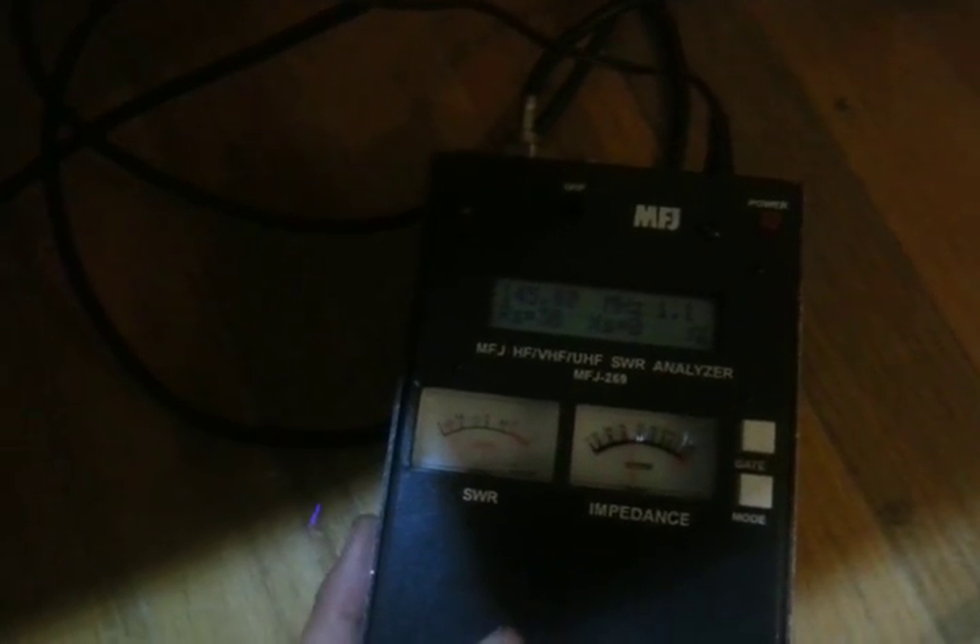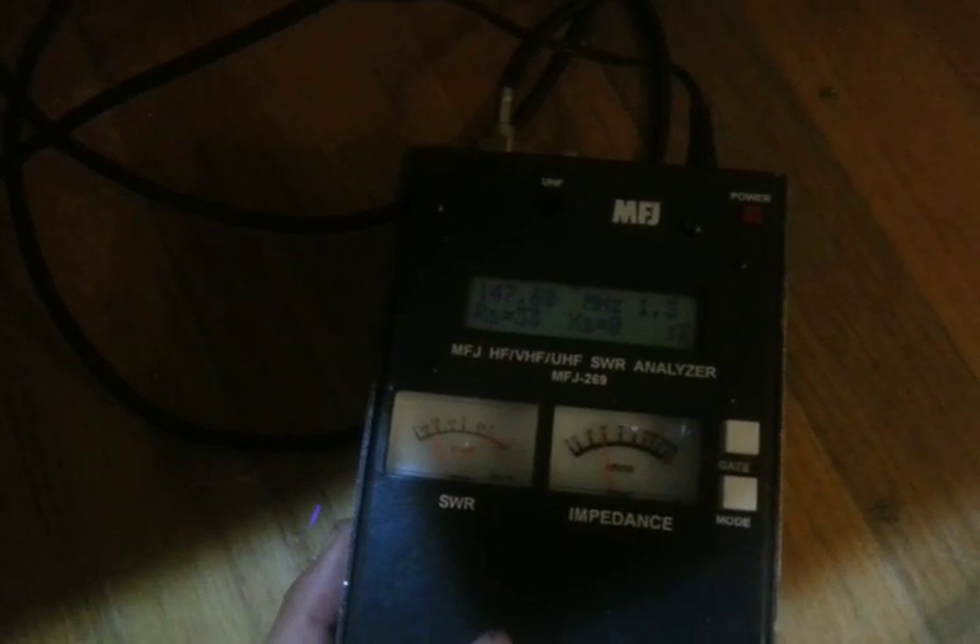1.2 to 1 SWR, and you can tune it around a little. If you were to build one for the home, it's usable for just about the entire ham band. It will add to the complex impedance of your existing antenna system. So if you're going to build one, build it with caution and pretty much to the frequency range you're going to stick to.